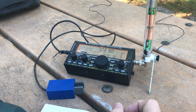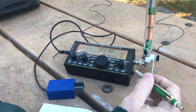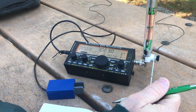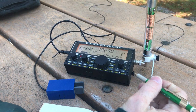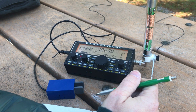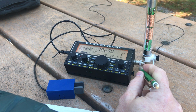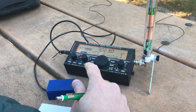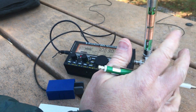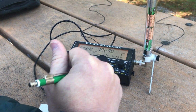And it's so versatile because it also has a really, really good antenna tuner in it. The ATU in this, I can pretty much tune anything with it, anything at all, and it works. I love that about this radio. I know that when I've got this with me, and if I've got my little paddles that hook onto the front here, I can operate pretty much anywhere CW. And if I've got my mic with me, I can do single sideband, and I can tune up anything. If I just have two lengths of wire, I've got a banana plug adapter thing I can put in there. I can put one radiator and one counterpoise out, and the radiator is usually about 28 and a half feet or something, and I can work, I think, all the way down to 80 meters even with it. Again, not efficiently, but I can do it.